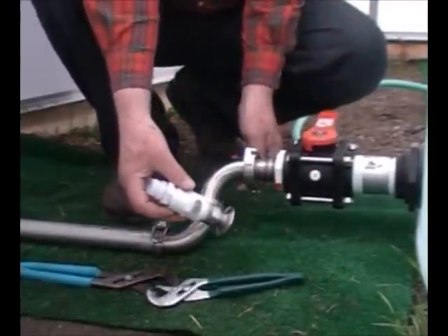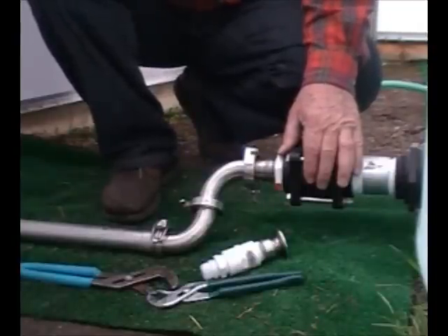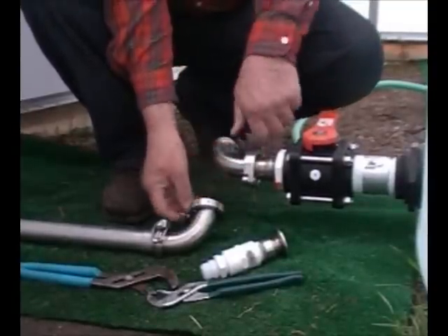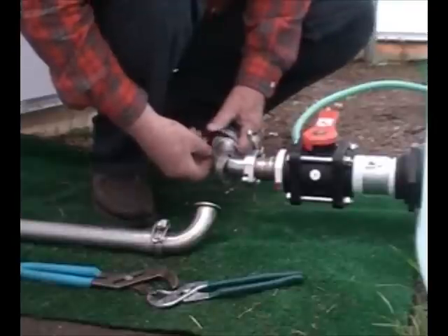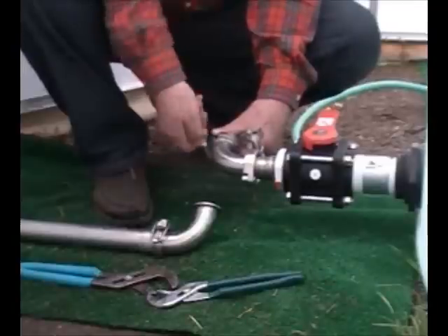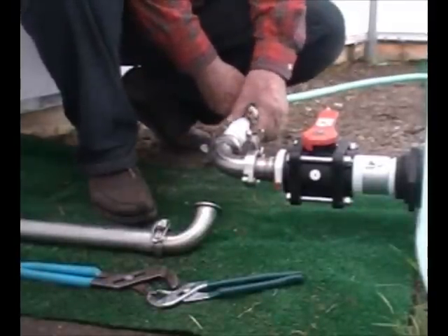In order to do that, we'll loosen this clamp. When we loosen it, we can pump this to pump the pipe dry. Then we can continue to loosen it, and then I'm going to swivel this — I can loosen this and swivel it. Then I'll attach the hose adapter, and then we can attach the hose and start filling buckets out the door again.